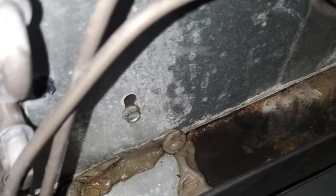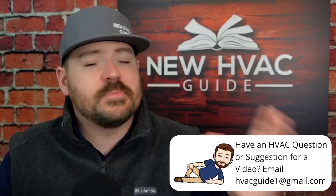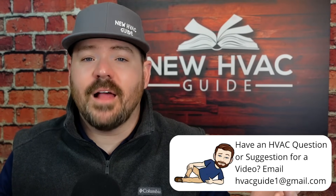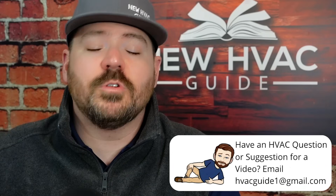The second area is the primary drain pan. The hope is that water coming off the evaporator coil drains out without any issues, but the truth is things can sometimes grow or develop in that drain pan. Depending on the system orientation it may not even be possible, but if it is, I'm mounting that light to shine on as much of the return side of the coil and as much of the primary drain pan as possible. And not all UV lights are created equal — some don't seem like much at all, while others in commercial systems look like they'd shine the entire country.